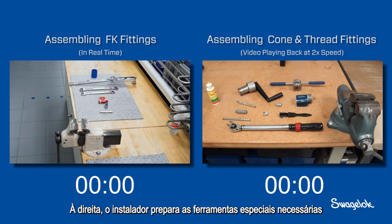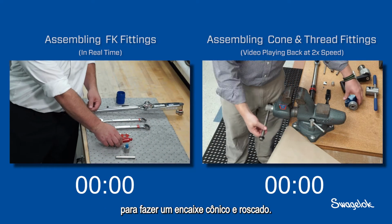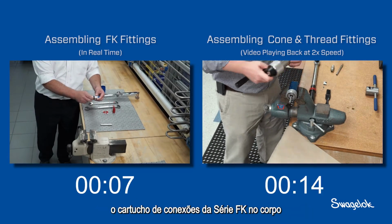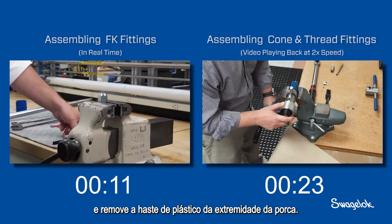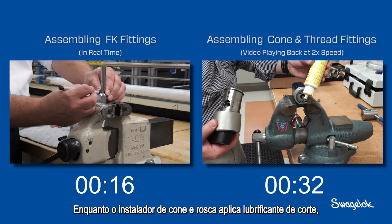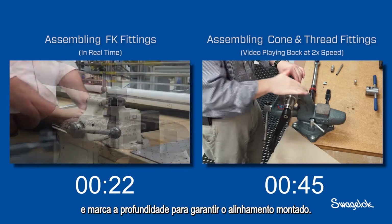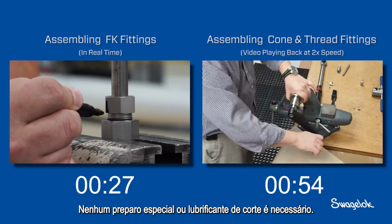On the right, the installer prepares special tooling required to make a cone and thread fitting. As the cone and thread installer prepares the tube, the FK series fitting installer simply threads the FK series fitting cartridge into the body and removes the plastic arbor from the end of the nut. While the cone and thread installer applies the cutting lubricant, the FK series installer inserts the tubing into the fitting body and marks the depth to ensure assembled alignment. No special prep or cutting lubricant is required.